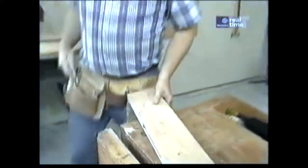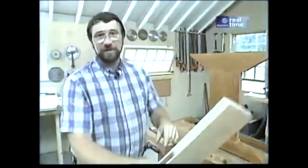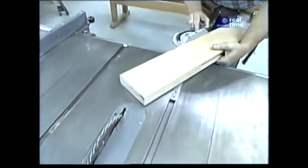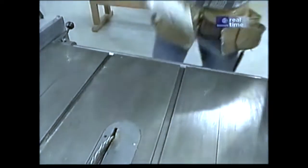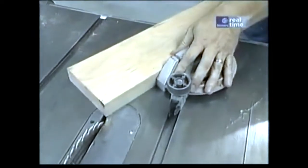The next thing is to cut the angles on the top brace, which is 60 degrees — a steep angle. I'm going to do it on the table saw with my T-square. If you pull the T-square back to get started, it goes off the end of the table and isn't very steady, so I'll just turn it around, which will make it a lot easier and safer to make this cut.